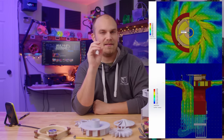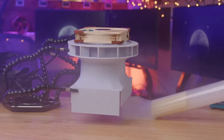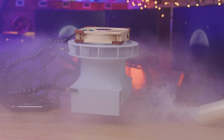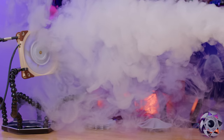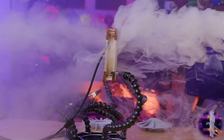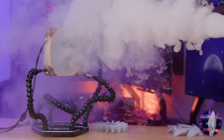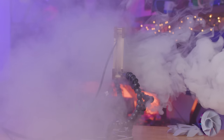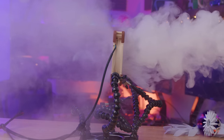Going back to the screenshots Nikola provided in his flow simulation, we can see if what he showed in the sim matches real life. For the most part, things look pretty close — we can confirm without a doubt that the air is being pulled up through the cooling tower. However, something not evident in the simulation photo are the little eddy currents being created as the air exits the fan. I'd be interested to know if zooming out in the flow simulation would reveal those same eddy currents. Random Swiggles seems to be performing quite well, with air being drawn in pretty uniformly. The Yes Sir looks pretty standard at first glance, but if you look closer, the airflow appears to be thrown out towards the side, and the side view confirms this — the air is pretty turbulent. The Daisy seems to be acting pretty much the same way; the front looks smooth, but the profile shows pretty turbulent flow.